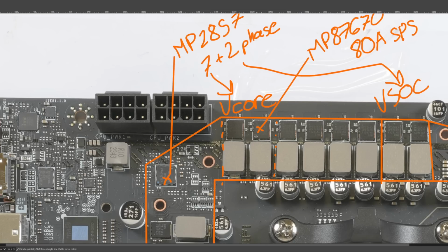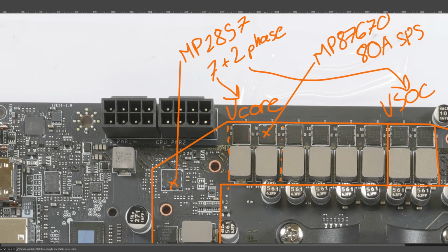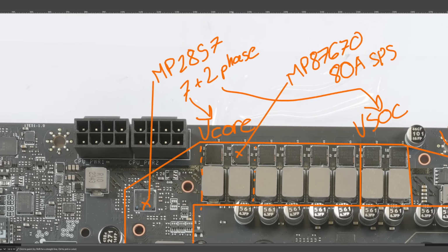I mean, the main thing is the monitoring. The defining feature of smart power stages is that they have a dedicated current monitoring pin that just connects to the controller, which makes VRM design somewhat simpler. And also that current monitoring functionality built into smart power stages is generally more accurate than the current monitoring that you get with normal DRMOS components.